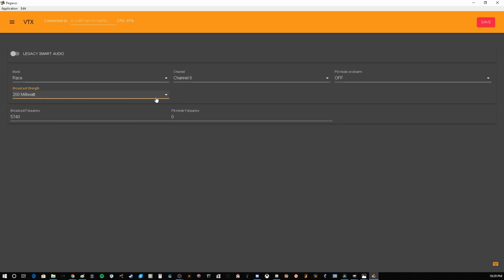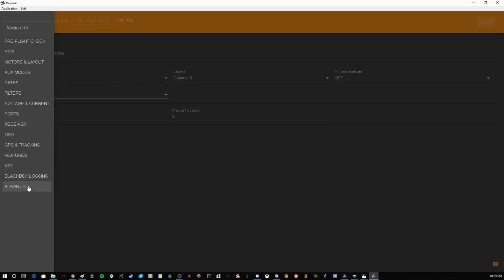So I always set up mine on race channel 8, 200 milliwatt. Go ahead and save. So when I hook up my Unify, it will automatically come up set on the right channel for me. And that's pretty much it, guys. That's the gist of Pegasus. I will touch on this further in the next video.